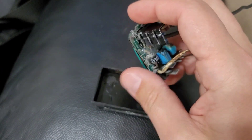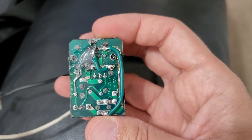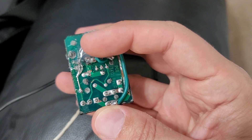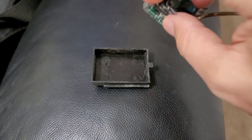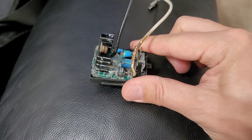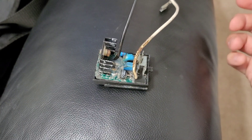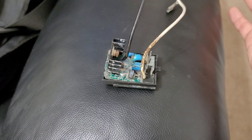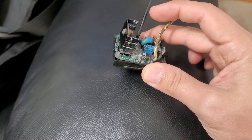After the board is repaired I use hot glue, although you could use other things. I already had to repair some of the traces underneath — one going to one of the main spade connectors — and because of all that damage I had to make a jumper wire for the center pin of the silicon controlled rectifier. After testing, I'll put this back in and put some hot glue around it to seal it in its tray. Hot glue has a lower melting point than normal epoxy; it's a thermoplastic and maybe not the best material, but it makes it much easier to service later on if you need to.